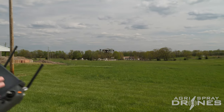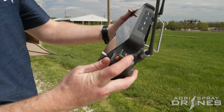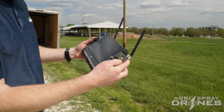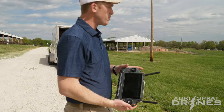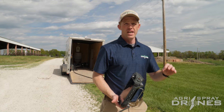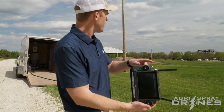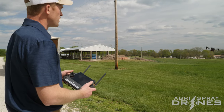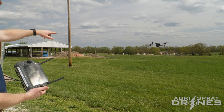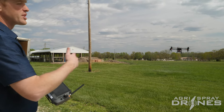There are a few things you can do. You can switch back and forth from your camera to your map by tapping on the camera or map picture in the bottom left-hand corner. You can also use the camera button to switch screens. You can move your camera up and down with your left dial if you want to look at weeds right underneath the drone. Turn it off with the red button. The drone will not control rate or turn the sprayer off except for two instances: if it sees an obstacle and stops, the sprayer will shut off; or if you fly backwards, the sprayer will shut off. I can spray left, right, forward, or diagonal — but if I move the stick back and fly backwards, the sprayer shuts off. Once you stop, it turns back on. This is so you don't cover the drone in chemical or retrace your steps.